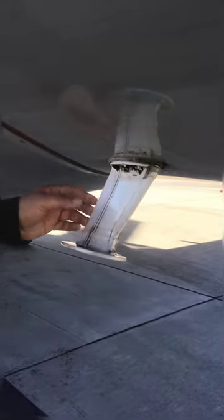This is the SATCOM. Make sure it's secure. All your sealants, all these panels — we want to make sure. When looking at these panels, all these screws — we want to make sure they're secure. We don't want any of these screws missing because if one is missing you'll have to verify it's allowed to fly that way. Most of them are not — you have to have almost 100% of those screws. When we look at those screws, they're all in.